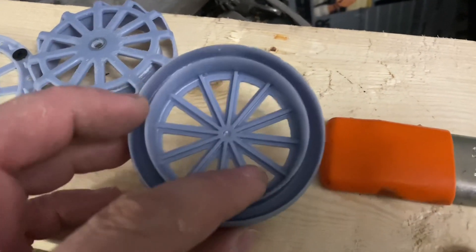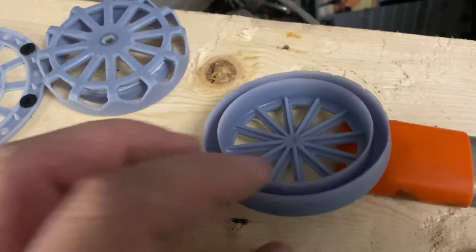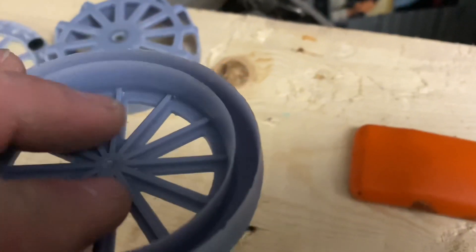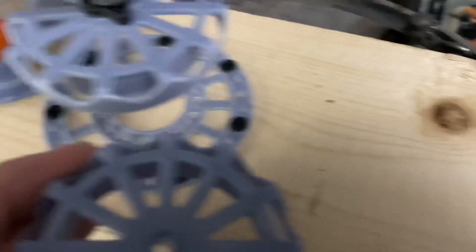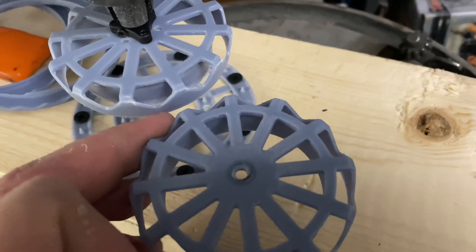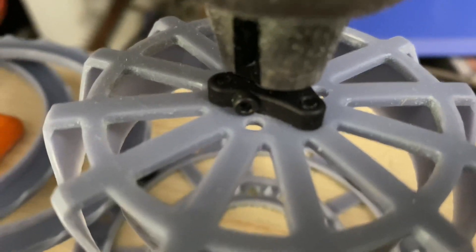The other problem was this was too short, so it was grabbing on the cores and really tearing everything apart. When I cut these they were kind of smashing the foam so they weren't coming out round — they were kind of tapered on a weird angle, which I thought was just everything getting compressed. So I changed this up and did it differently on the second one. The second one is very similar to the first one — I did try putting a four-millimeter screw and nut through it but had trouble with it slipping.